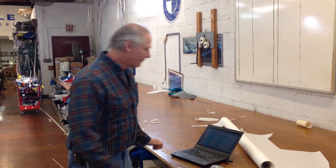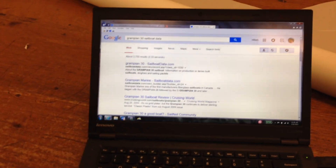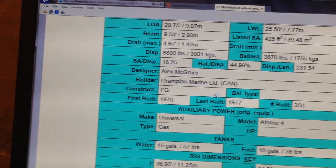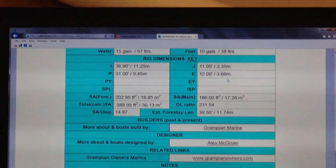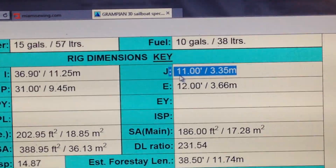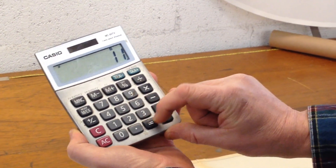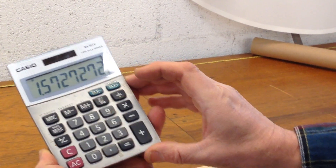What you can do then is go online and find the principal sail dimensions — principal rig dimensions — for your boat. I've done a little Google search here. There's a website that's pretty good for this for old boats, really good actually, called sailboatdata.com. I found my brother's Grampian 30 here, and the J dimension of his boat is 11.0 feet. So to determine the percentage, we take the LP — the girth — 17.3 divided by 11, and it tells us that the sail is approximately 157%.